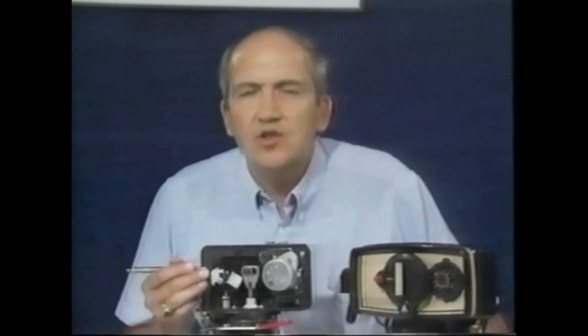In the case of cutting the salt setting, you usually wouldn't want to reduce it for any reason unless you had extremely low hardness in the water and were close to the maximum gallon setting on the meter, which is 2,150 gallons. In that case we might cut the salt setting from 8 pounds down to 6, knowing that 6 pounds of salt with a cubic foot of resin gives about 20,000 grains of recovered capacity. With 4 or 5 grain hardness, you'd cut the salt setting to compensate and arrive at a gallon program close to the maximum 2,150 gallons. That's about the only reason I can think of — generally, demand systems don't cut the salt setting.